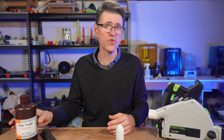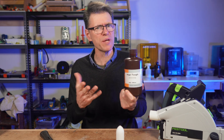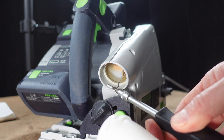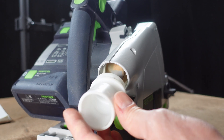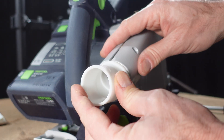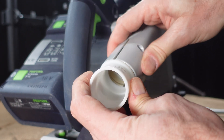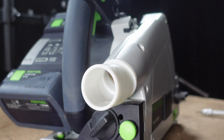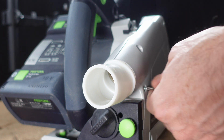Based on these tests, I can certainly confirm that you can use this Antinsky resin to make functional parts — it's that good. But what about print accuracy? I get a lot of questions from viewers about accuracy on tough resins. In my case, the part needs to fit into a space on the back of this saw where the dust is extracted. I designed nine holes to fit over three lugs in various alignments, and for this to work without excessive play, the resin needs to print within about 0.1mm accuracy. You can see here that the part fits nicely — not too tight and not too loose.